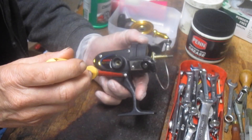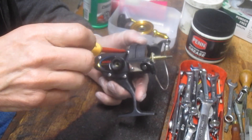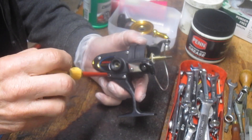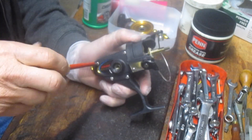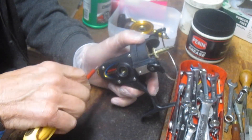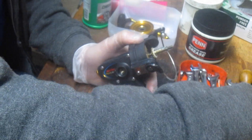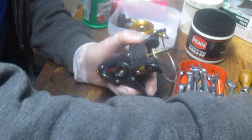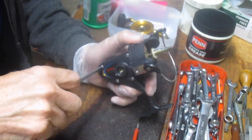It is — the plate is playing. It may simply be that this plate just needs to be tightened. These screws aren't set. I see this occasionally. If you use these on boats, the vibration of the boat will often loosen up the screws. And if you're not paying attention to it, you can be in a situation similar to what we've got here.